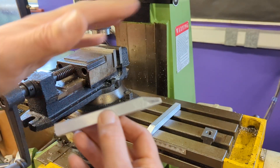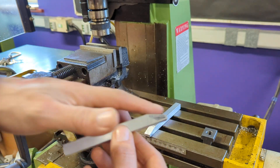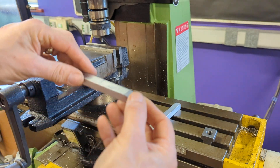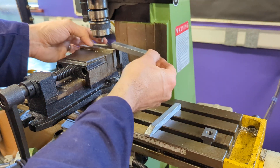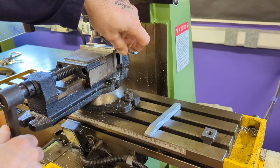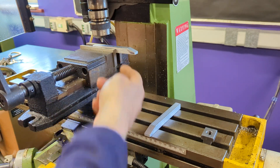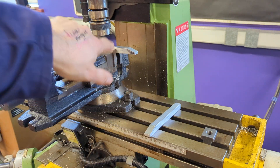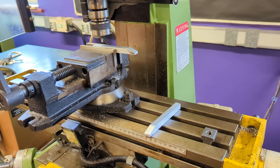Right, let's have a look - there's the aluminium, and you're going to be putting a sloped slot or sloped profile inside it. Now you could use the machine vice which is connected to the bed of the machine, fastened in and bolted in place. If you're using some packing material underneath your job to make sure it stays entirely flat, that would be quite a good way of doing that.